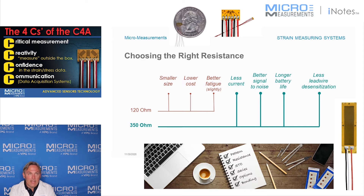What all that allows you to do is to increase the bridge voltage proportionally. And the reason that's important is as you increase the bridge voltage, that allows you to have a better signal-to-noise ratio, because in a Wheatstone bridge the output is directly proportional — the more input voltage you have, the more output signal you get.